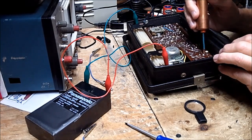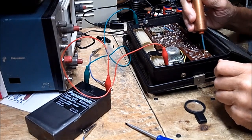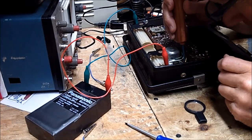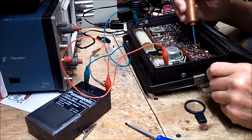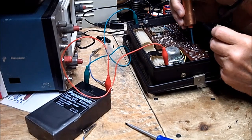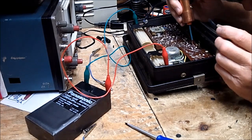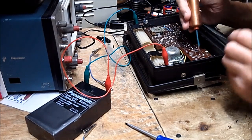I can tell you what all that noise is. The dehumidifier. I'll unplug it. Alright, so we're picking it up off the volume control. Trying to read off the speaker here. We might have an audio output transistor problem. So we're getting a signal here and a louder one here at the, I guess this is the volume control.